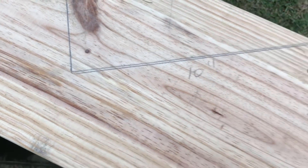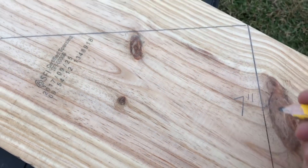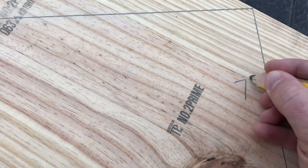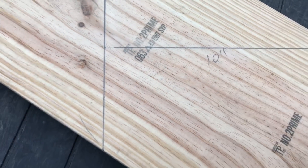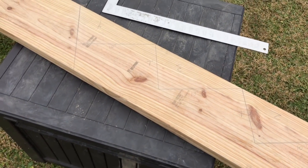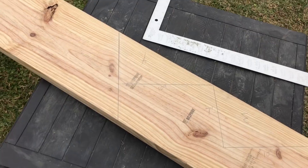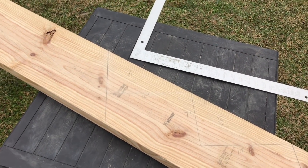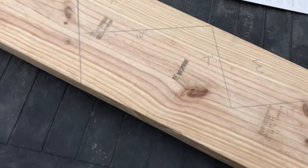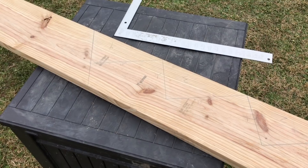10 inches of run — step 1. Here's step 2: 7 inches up, 10 inches over. Step 3: 7 inches up, 10 inches over. So that brings us to 21 inches up right now in the stringer, and we're going for 28. Now most steps, you don't cut that last stringer because your top step on the stringer would be right at the top of whatever you were building up to — 28 inches. So I'm going to stop my step right here at 21.